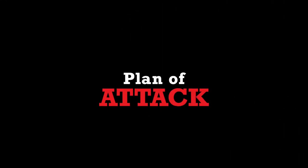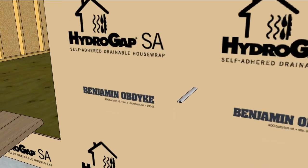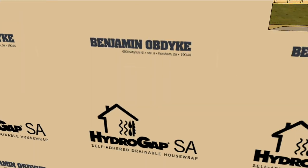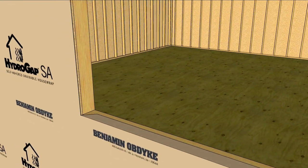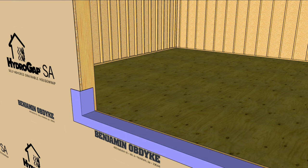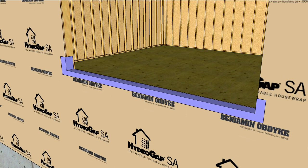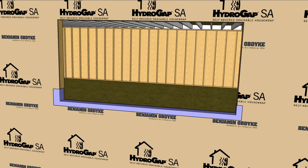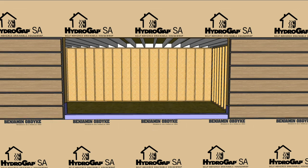Our bulk water control areas basically boil down to holes in the walls, like doors, windows, wires, and ducts. The house wrap folds over the window sill for an air seal. Over that, we'll apply a liquid applied flashing, which will provide water protection and another layer to the air barrier system. It covers the sill framing and extends up the sides of the rough openings too. Because we'll have an open cladding system on the house, we'll cover all the colors on the house wrap, but more importantly, we need to provide long-term UV protection.